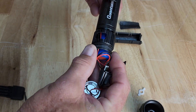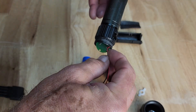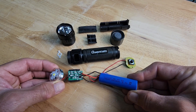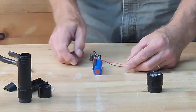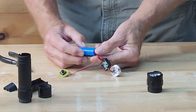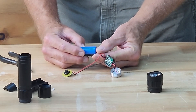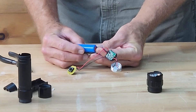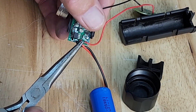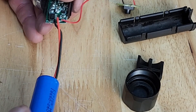That's coming out easily. Here comes the battery, and there comes the push button board behind it — so that got all the guts out of the tube. It says LQ 18650. It's an 1800 milliamp hour, 3.7 volts. You can see that this battery is soldered in to this circuit board, so that is not going to be just an unplug one and plug in another one sort of thing. I'm going to have to solder that.